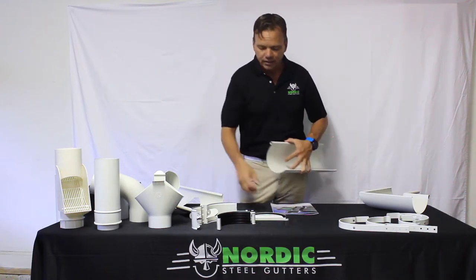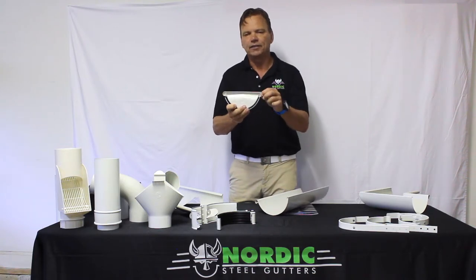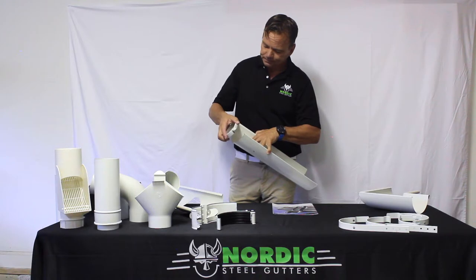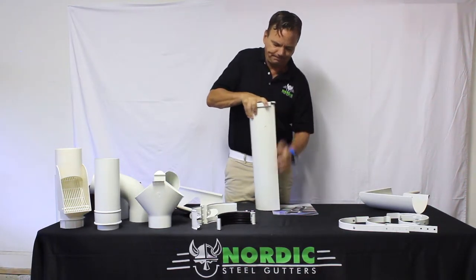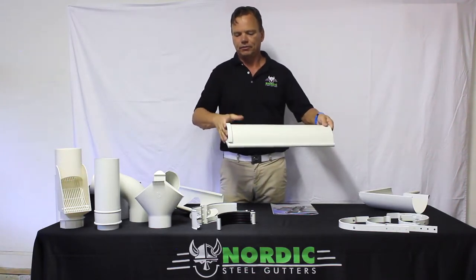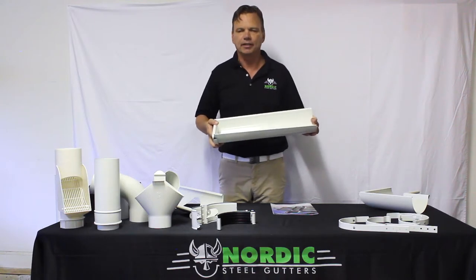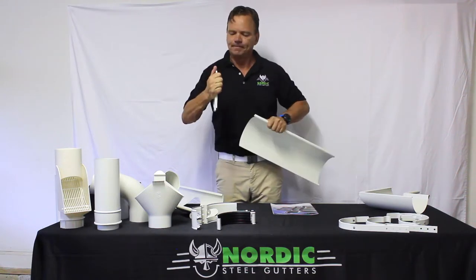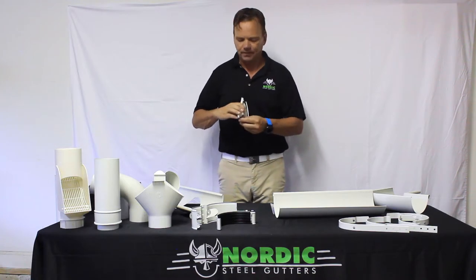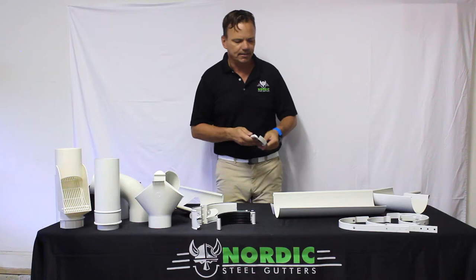Now let's start from the end, go through the gutters and go down the system. This is your basic end cap — it's a universal, works left and right. You can bend off the ear of the end cap that sits next to your fascia. You line it up over the gutter and press it on — now it's already connected and it's not coming off. These are all EPDM rubbers; you'll be using them in roofing for 50 years and that's all that's needed. There are four flanges on the end cap that grip the gutter. It comes on in seconds and you keep going.